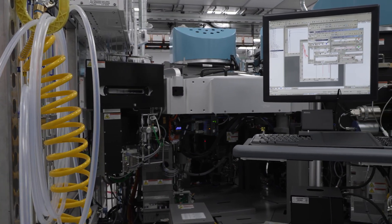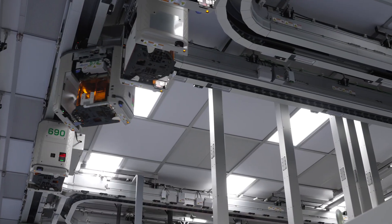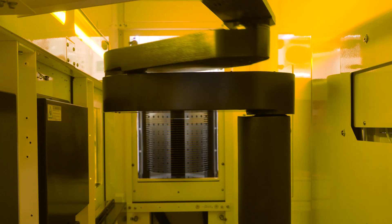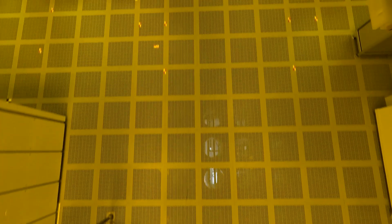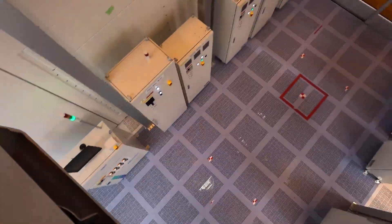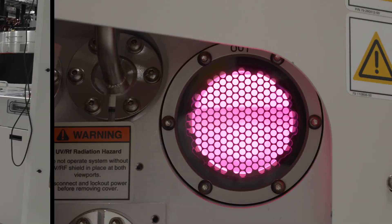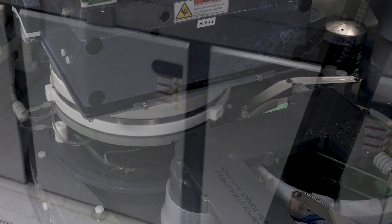Next, we add layers. We add an insulated or metal coating onto the pattern we just etched, and then we repeat the steps: imprint a new pattern, add material, and etch material away — over and over again. We customize the electronics throughout the manufacturing flow by bombarding the exposed areas on the wafer with ions. This changes the conductivity of the silicon and creates electronic components. In order to create uniform surfaces, each wafer is polished at several stages throughout the process. This creates electronic pathways to interconnect components within and between each layer.